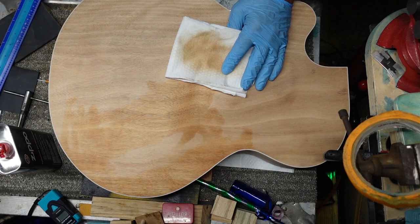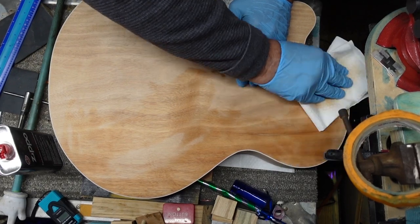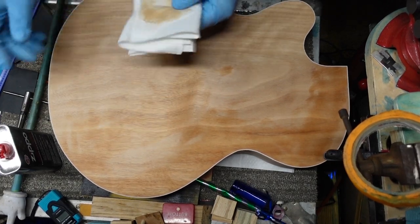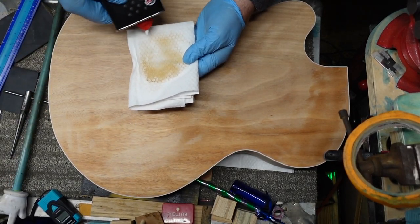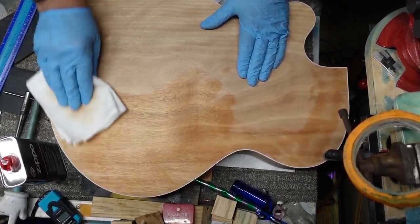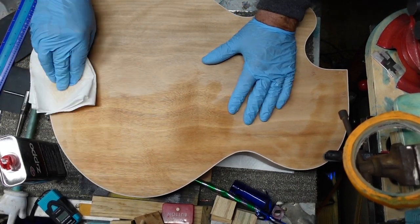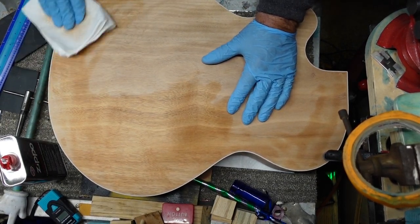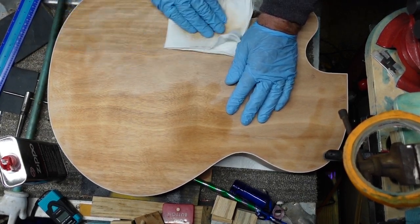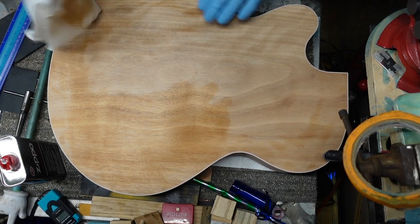That's historically where I've had some problems, and if you're using a really dark stain, like oak gall ink, that stuff is unforgiving. You're trying to sand something down after the fact and putting more coats on. Well, everything is getting darker and darker except what you want. Just remember, especially where the arch comes up, right here where this concave is, that's where everything will collect. Just can't put enough time into doing this. Shortcuts don't look good.